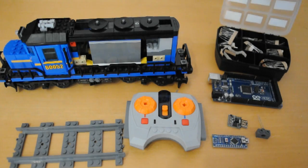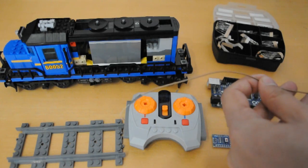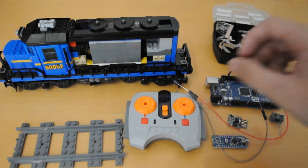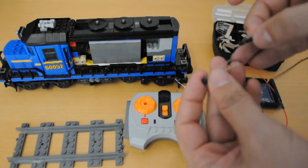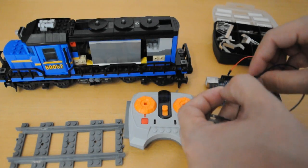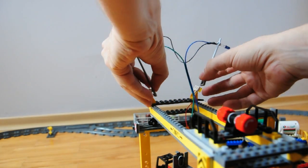So we choose a 39 ohm resistor, connect it to the LED, add some wire and some pins, and plug it into the Arduino. If your track's really big, you can add more than one LED so the Arduino can always send a signal to your train. Just change the number of LEDs to 2, and you can see we link the LEDs together and add a smaller resistor. I've used some more wires to keep these LEDs apart, and added two long poles to help lift them above the track, then clip them to my loading station like this.